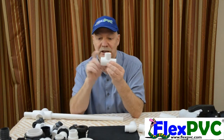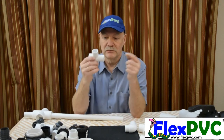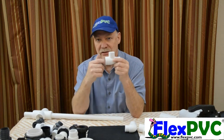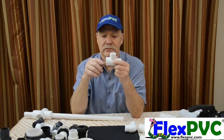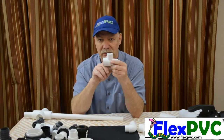You have it in, you have it out. A little hole in the middle. Pressure comes this way, high-speed water comes out this way, creates a vacuum in this chamber, sucks whatever's here through. Generally, this is air or some sort of gas. You can draw a liquid, but it's much harder.